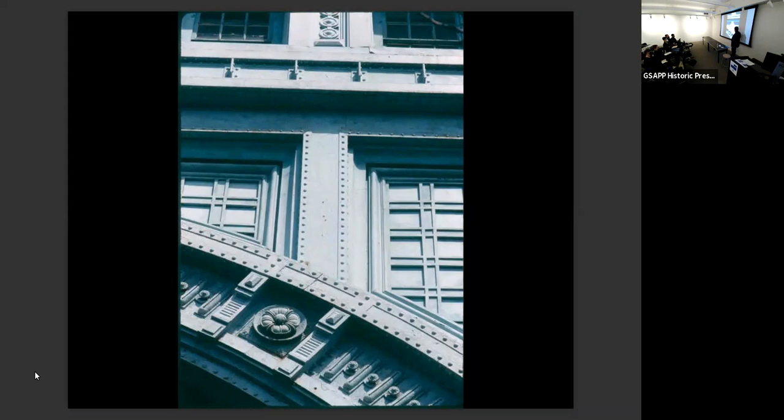That's all cast iron. This is riveted steel plate, and these are those copper and tile frames, which were basically in good condition. So in order to save about $5 million, we left all this steel, which allowed us to leave these copper frames and tiles in place. We took these off and treated them separately, but left the steel in place and repaired damage to the steel arch behind here in situ. So that saved about $5 million.